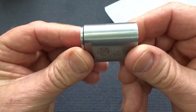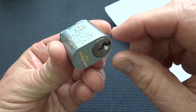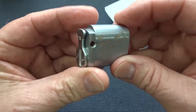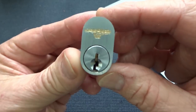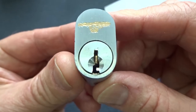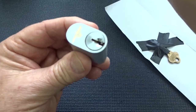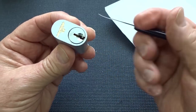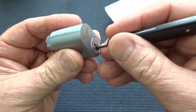I don't see anything on the outside other than it took a lot of time to engrave it. No drilling to put in any side pins, so we've got no weirdness. I think we're just going to be dealing with six pins. It's a nice wide open keyway. I believe it is a Lockwood. I think I can use top of the keyway.